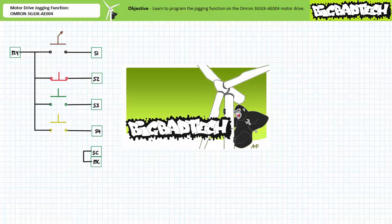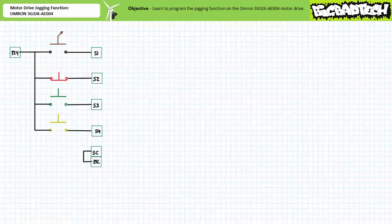You'll recall that jogging using an electromechanical contactor is the harshest of experiences, necessitating an electromechanical contactor make and often break inrush current. Additionally, the jogging experience making use of a primary voltage source with a fixed excitation frequency is characterized by a rapid acceleration to full speed and an extremely imprecise stop, often necessitating the inclusion of a spring-applied electrically released friction brake to increase accuracy.